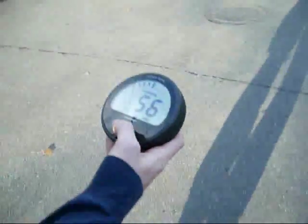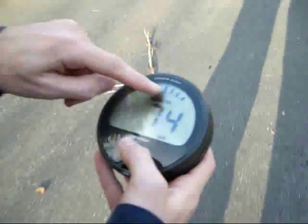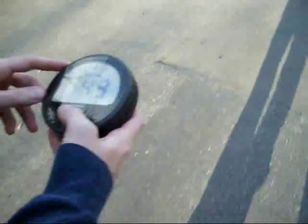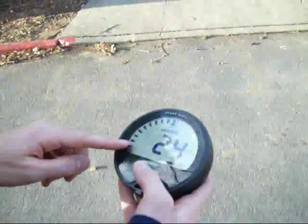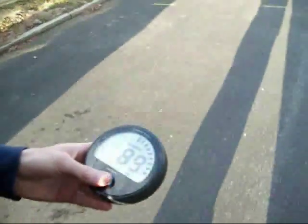One of the additional features when you're in heading mode is this heading lift indicator. Once you're sailing on the same tack for at least 20 seconds, these little indicators pop up. Each little bar is three degrees. So you know when you veer off of the heading you were on — I keep going more to the left here, now we're way off where we were. If you come back, it'll come back to the middle. It's an up/down indicator of how far off you are. If you tack over, once you're on the new tack for 20 seconds, it resets and starts giving you the same indications.